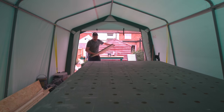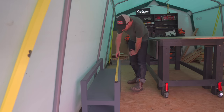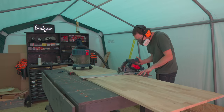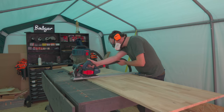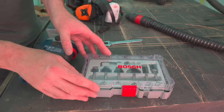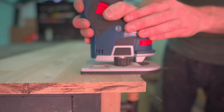Now for the top of this — which you're going to be able to sit on — I'm going for some engineered oak. It's a bit like a kitchen worktop, but thinner. I work out what size I want it, get it marked out, and then I'm going to use the track saw again to cut it to size. I want to add a little round-over to three sides of this, so I get the bit put in my little Bosch trimmer and add that on.